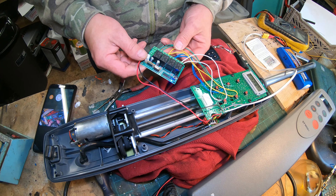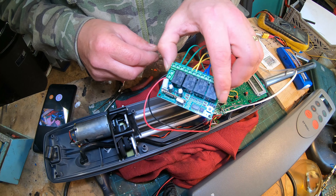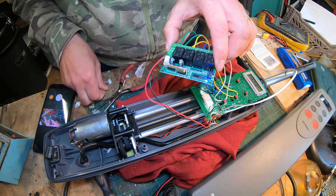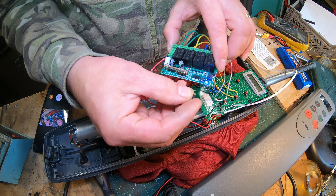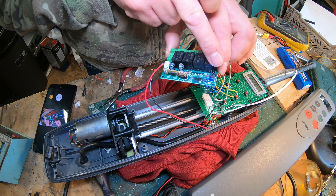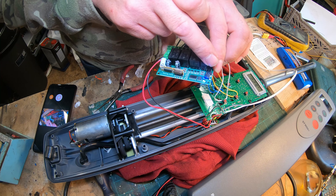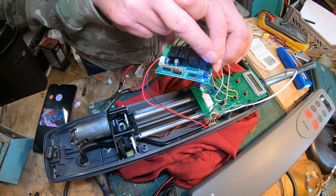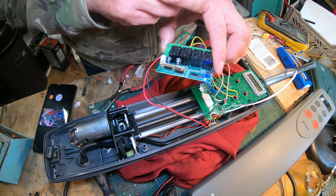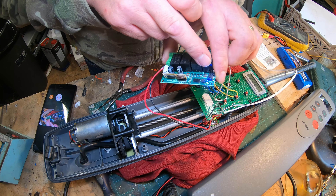Right, I'm back. Figured it out — I read the instructions. On here, there's a three-way jumper. You can see where it's positioned. You can take it off — like it's off now. Connecting the two left pins makes it an interlock: you press the remote button, the switch comes on, then you have to press the remote button again to make it go off, which is not what we want. We want a temporary connection.